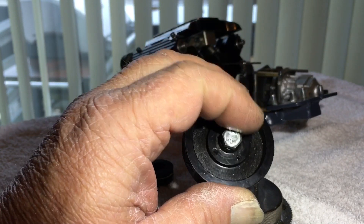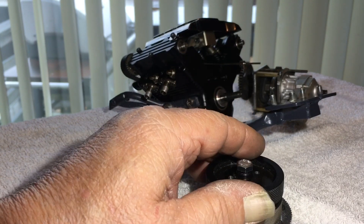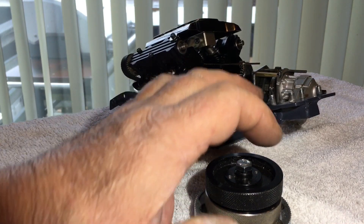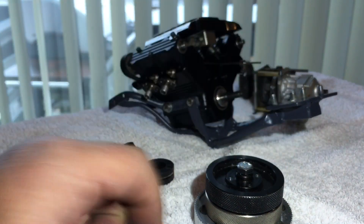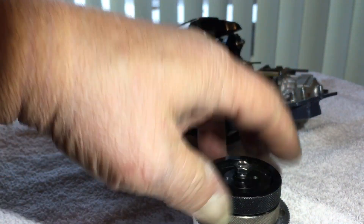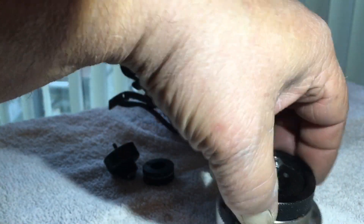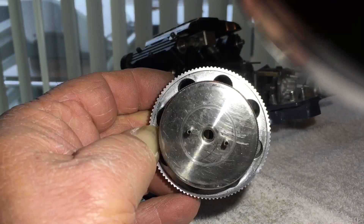When you do that, take the two outer holes — the 3 millimeter ones — and we have to get these two bolted together. I drilled it and I took some pins out of one of my other flywheels, which I think are around sixteenth of an inch pins. I drilled them, made sure they were centered, then tapped the pins in. Separate the flywheels first, then tap your pins in. What I came up with was a perfect circumference for my flywheel.